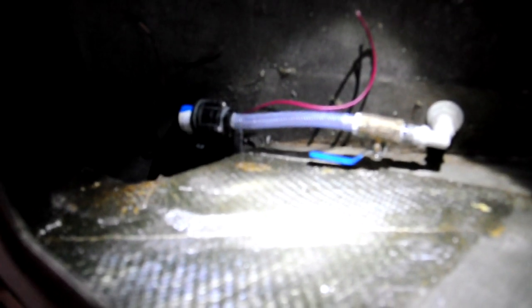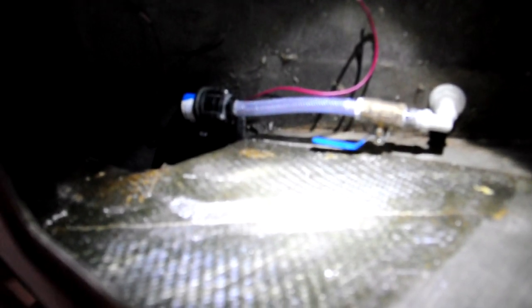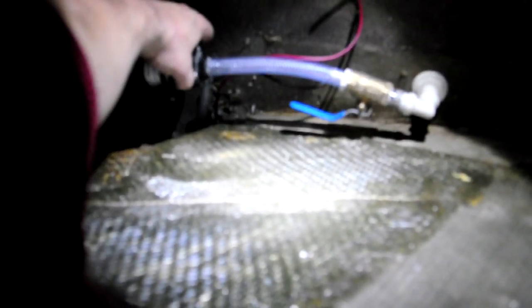The location for the water pump. It was up under the sink, and it was quite a ways above the water line. The pump was located up there, so I think they were having problems with it getting primed, because they had kind of a check valve hooked up and stuff. So I'm going to locate it down here, so it'll be closer to the water line. Put a new seacock and through hole in. Everything's just dry fit right now to get the layout for everything.